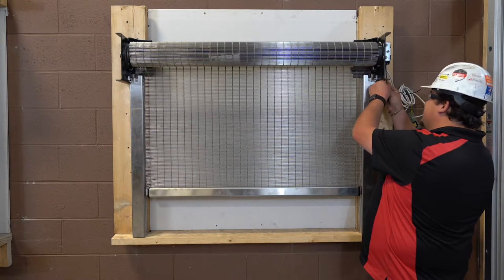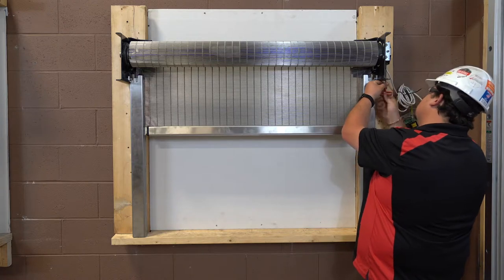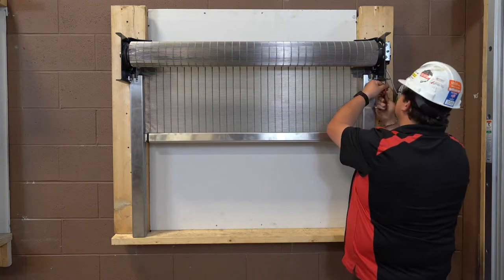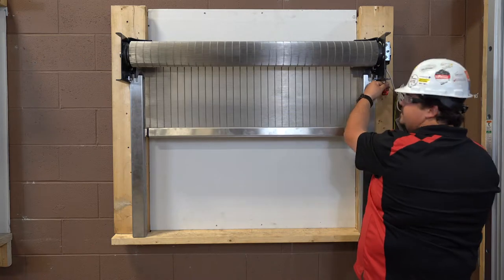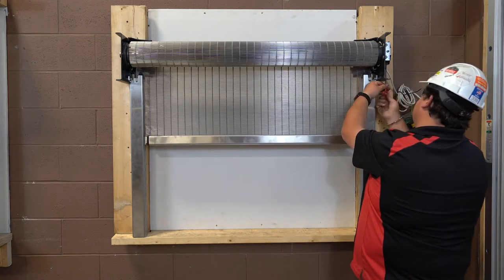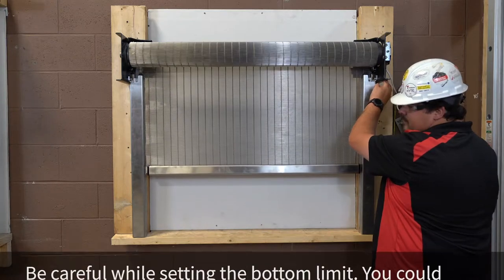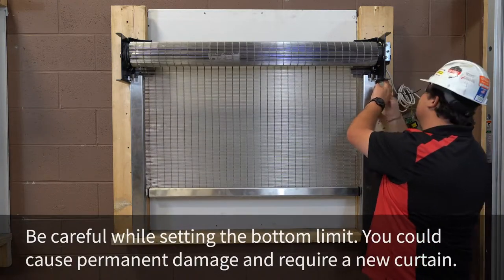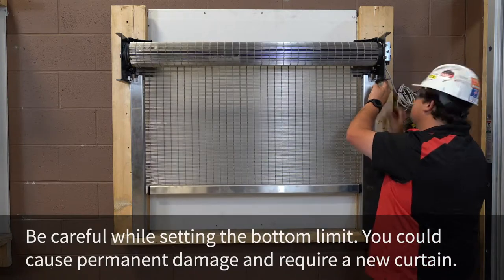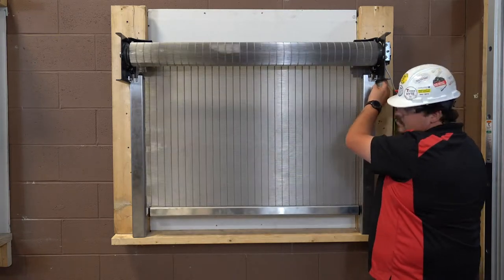Now it is time to set the limits. Please be extremely careful while setting the limits of your steel weave curtain. Start by setting the upper limit to the desired height. Please note that the wall brackets have integrated stoppers to act as guides for the upper limit, but should not be used to stop the bottom bar. Next, you want to raise the curtain up to three inches below the desired height and slowly adjust the limits one click at a time until the upper limit is reached. If you set the lower limit too low, you can cause permanent damage to the curtain, which could require replacement. Now you will lower the door to approximately three inches above the floor or the desired closed position. Slowly adjust the limits one click at a time until the lower limit is reached. The limits of the curtain are now set.